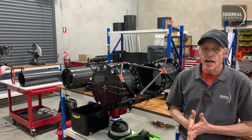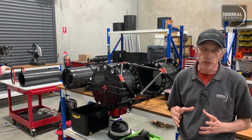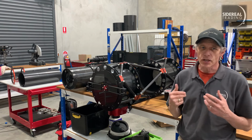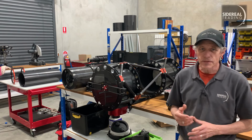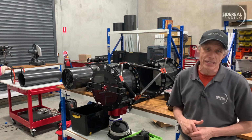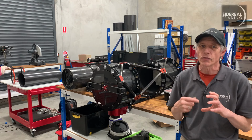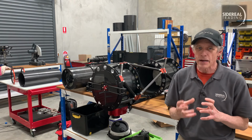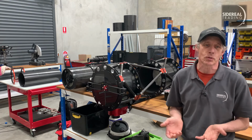The client is after a QHY-268M that's going to go with a 7-slot filter wheel with Antlia filters. It's going also with a medium QHY off-axis guider. The thing that makes it a little bit non-standard is it's being mated with a Baader MPCC-III coma corrector, and if you take off the 42mm thread on the MPCC-III, that's got a back focus of 58mm, not the standard 55. So let's have a look.